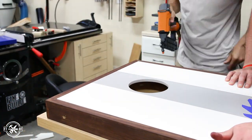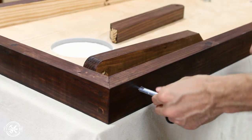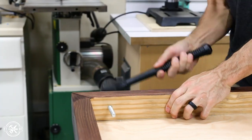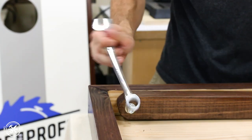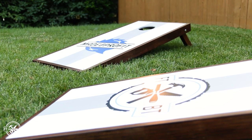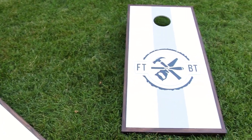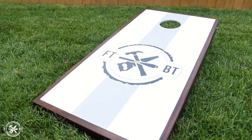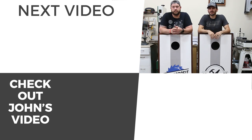I also gave each of the boards three coats of water-based polyurethane. The last piece was to mount the legs to the frame — we pounded in a bolt from the outside and placed a washer on both sides of the leg with a lock washer and nut on the inside to hold everything secure. I love the way these boards turned out and the logos look really cool. If you're a cornhole purist you might want a seamless top, but these boards still play fine and add a ton of style. Check out the Made for Profit podcast where we talk business and help you monetize as a maker. If you're not subscribed to the channel already I'd love to have you, and check out John's channel as well. Until next time guys, get out there and build something awesome.